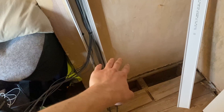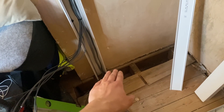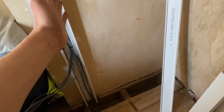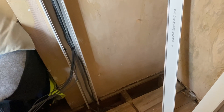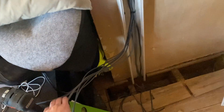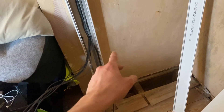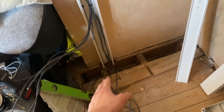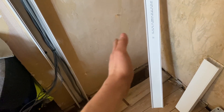The reason I've not put the clips too close together is that the boxes are going there. I'm going to get a four-inch piece of trunking, hook that up at about floor level, go across, and then have two AD boxes next to each other. The customers have their shelves in this unit and they'll build it around what we do here. The upstairs light cables will sweep up into the first box closest to the trunking, and the downstairs light cables will go up into the trunking and across into the bottom of the second box furthest towards this wall.